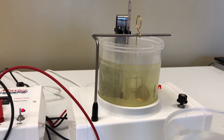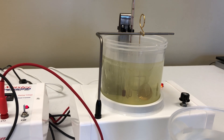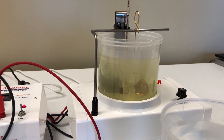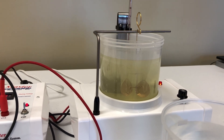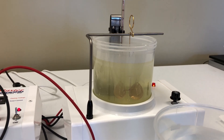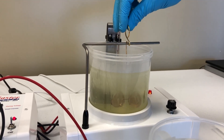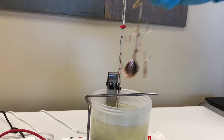This station is critical if you're going to be doing rose gold — yellow gold first and then rose gold plate. I'll get it up to about 150 degrees, which is important because nickel also requires higher temperatures to work well. After about 30 seconds these will be a nice rose gold color. You can plate them up to about two minutes before you start to get a little haziness, but 30 seconds to a minute gets a nice rose color. They're looking great.